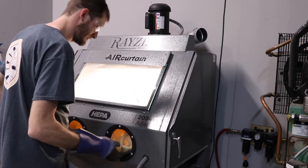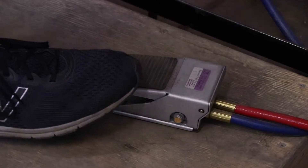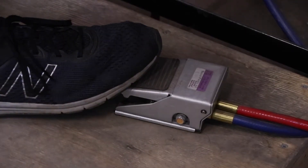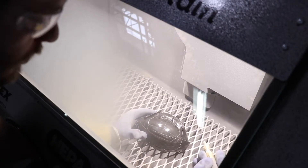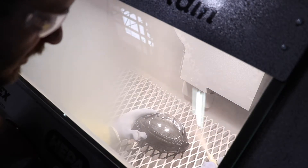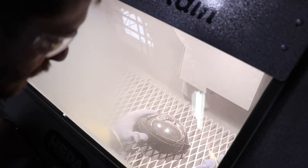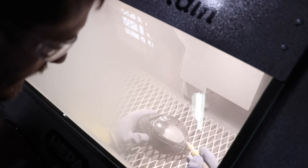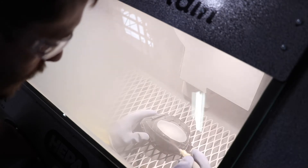It's good to wear gloves. To engage the blaster, you want to step on the foot pedal and that will start the blasting material coming through the gun. When you begin to blast your work, it's good to start the blasting away from the work — you'll get a little extra blast component to come through at first — and then bring your blasting down onto your work. In general, you want to go nice and evenly back and forth to blast the work.